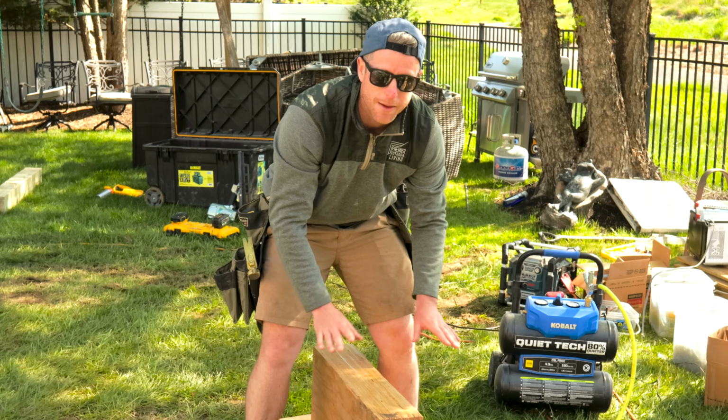So it's very important that we make sure of this. Get it? Same thing back there. 6x going straight from our beam on the deck all the way up, support that ridge. And that is going to allow us partially to do this phantom post in our corner because our ridge beam is going to carry a lot of that load, especially because we have a lower pitch here. So all these parts work together, as do we, to make this come together.